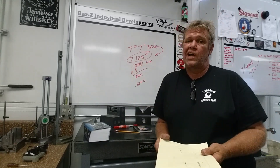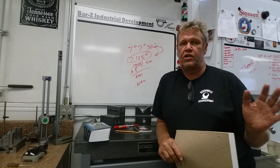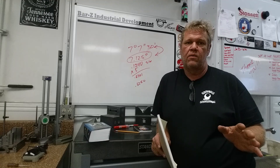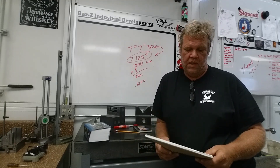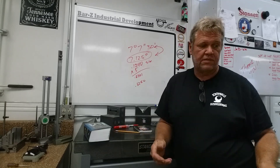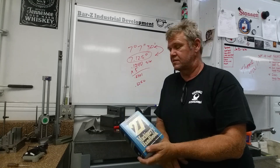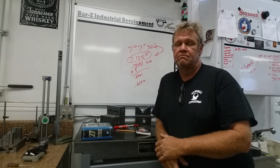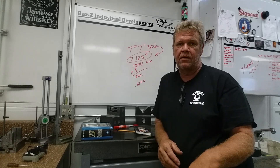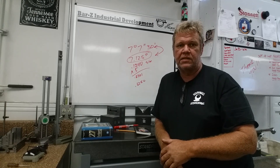At a small angle it's not huge, but get to those steep angles and your tapers aren't going to fit. I've already shot all the video and made all the corrections — I'm just doing this as an addendum to let you guys know the correction was made. The error isn't huge and my taper fits fine now. The black book is good for quick reference, but Machinery's Handbook is the bible — I should have followed procedure and not taken a shortcut. Enjoy the rest of the show — we're going to cut the blank with the corrected angles.